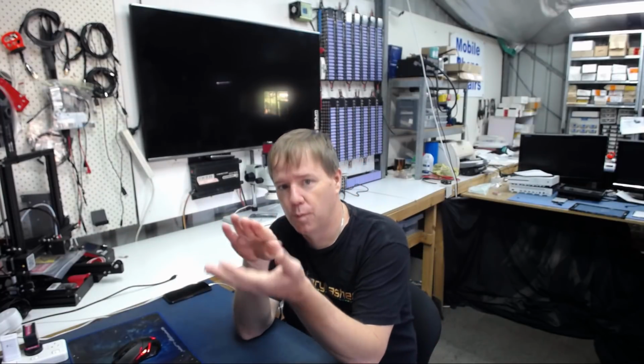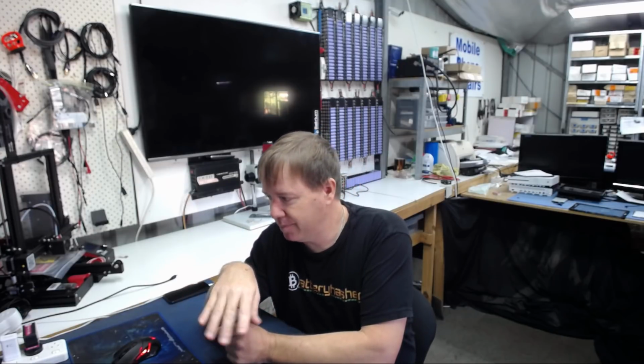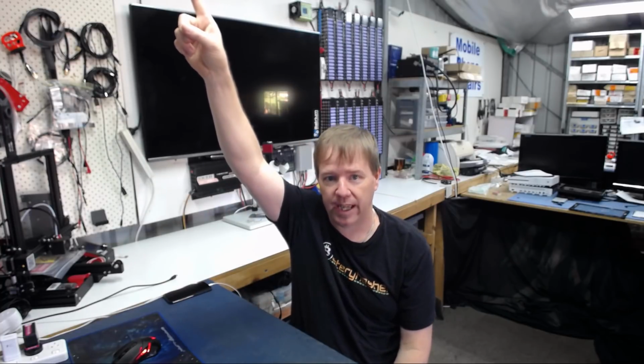Inside my box, an Australian meter box that sits on the wall, it's got little vents. So I cleaned the vents out, which were very dusty, with a toothbrush or something, then got a screwdriver and very carefully opened the vents up by an extra 1 or 2 millimeters. Then I went inside the box when the Sparky was installing everything, and we moved a whole heap of the cables around at the back. It's almost like a chimney effect where it does get nice and warm inside my meter box with the Eddi in there, but because the heat can rise up through the wall cavity and into the roof, it just thermal siphons through there, and it's not horrible.